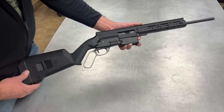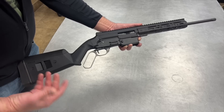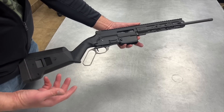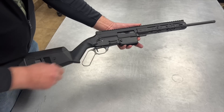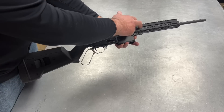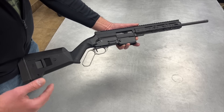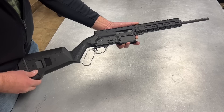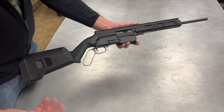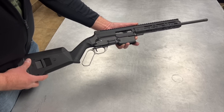The three things you need to change calibers — barrel, bolt, and magazine — are all completely AR compatible. On top of that, we've got compatibility with uppers and handguards, but there's a distinction between compatible and optimized. Even though we can use standard AR parts, we also have an opportunity to optimize for this application. For example, we could use a standard AR barrel, but we don't need a gas port or the journal features. With uppers and handguards, we have an opportunity to pull about a half inch of height out and push the optics even lower.